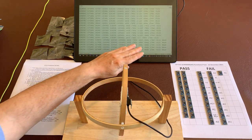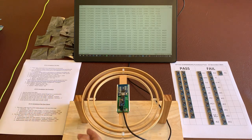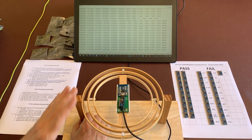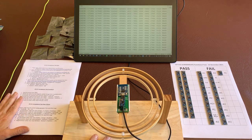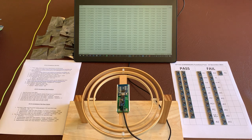Now you may have seen the pass indicator come up. It's important to stress that our pass criteria is not very strict. We require the sensor to have at least 90% of the range specified in the datasheet and the offset of the sensor to be about one third of that range. We're sitting at an anti-static workstation, connected to ground, so there's no possibility that we're going to damage any of these units.